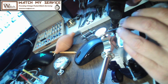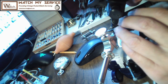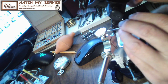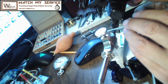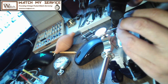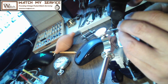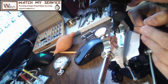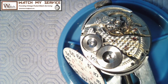I've got my glasses and I'm burnishing the pivot - I believe I'm working on the upper pivot there, removing material to size it down because when it was installed it just wasn't running smooth. All you really need to do is put it in without the hairspring on and then take a puffer and blow some air on it - you can see if it's spinning freely when you puff it with air, it's going to work really well with the hairspring on. I'm just taking a bit of material off. Caution: you can't add material after the fact, so watch how much material you take off - you can't make a balance staff longer. I did the work and completed the watch and it's working impeccably.